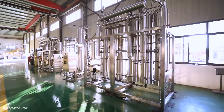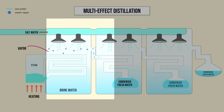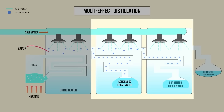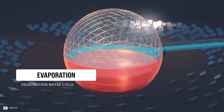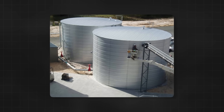Conventional multi-effect desalination is like a chain of steps. It starts by turning salt water into water vapour in one chamber, then uses the warmth from this vapour to heat up salt water in a second chamber, making it turn into vapour too. That vapour can then do the same in a third chamber, and so on — so the heat that would normally be wasted is instead reused. Similarly, the solar dome would use the generated steam to heat salt water in a second tank outside the main dome. Using the heat from steam to desalinate more water is a much better use of energy than trying to turn a turbine.